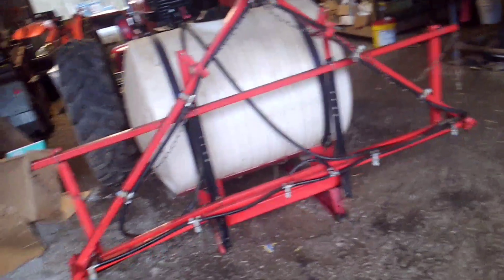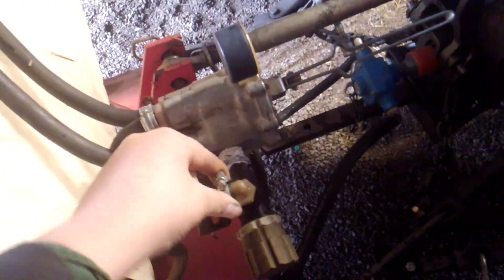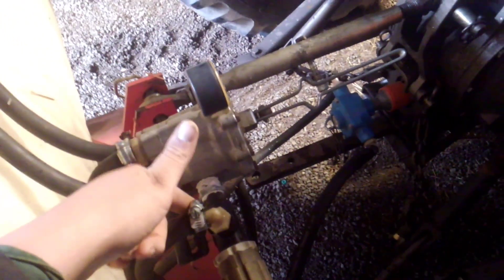There were a couple of fittings messed up on the end. I had to put a new fitting on. It's a 30-foot boom, so I wanted to get it going for pasture spraying. This fitting here was broke — it's a little spacer fitting, goes into a three-quarter and then down to a half. That fitting down there was pulled out because the hose was too short, and every time you'd pick it up it would strip it out.